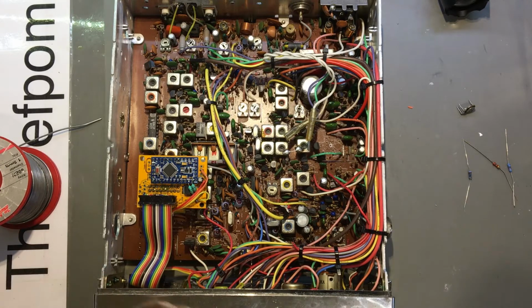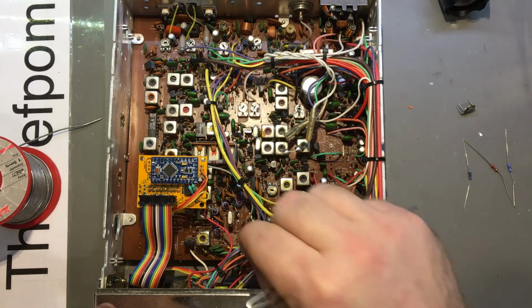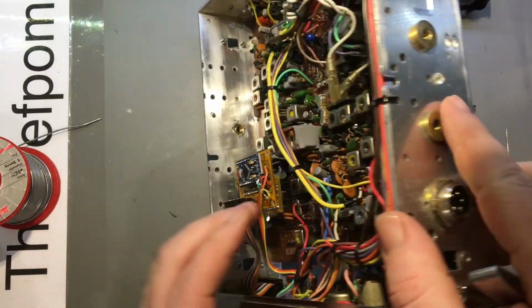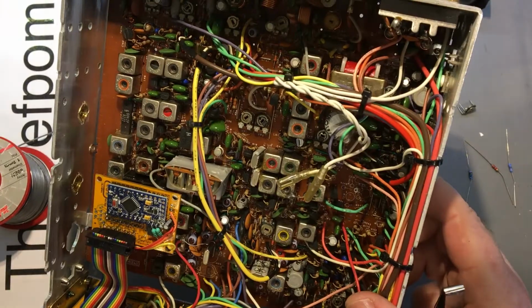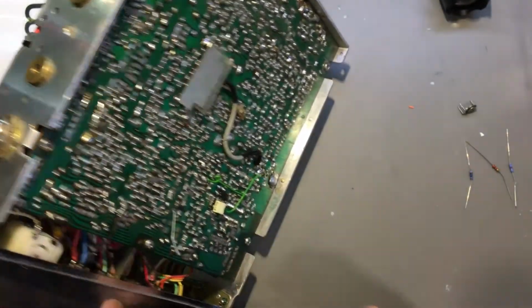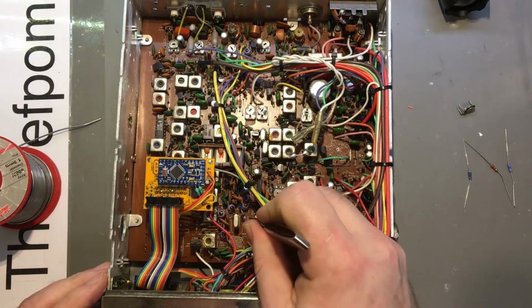I've got the parts lined up just here in value. So that's 100 ohms, 2.2, 8.2. Well, sorry, 2.7, 8.2. And I'll go to the diagram in another section of the video and show you what those parts were and what they do. So this is D75 I'm putting in. Okay. So this is a silicon switch diode. 1N4148 is what I'm using. Okay, so that's in there.